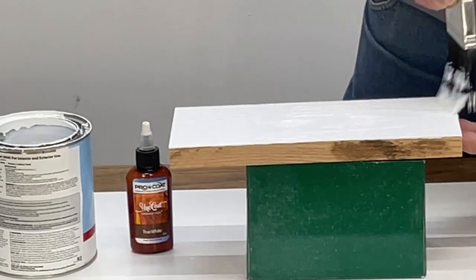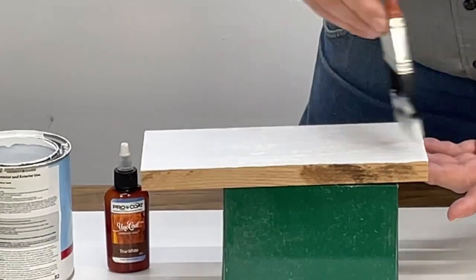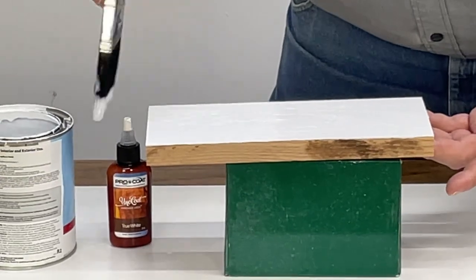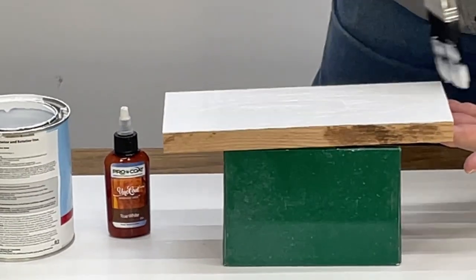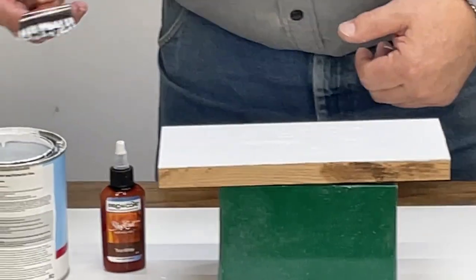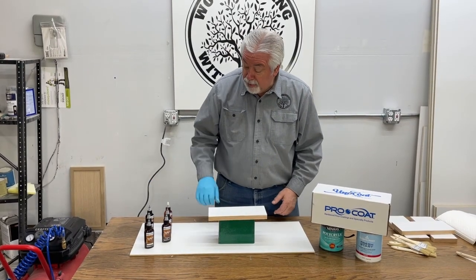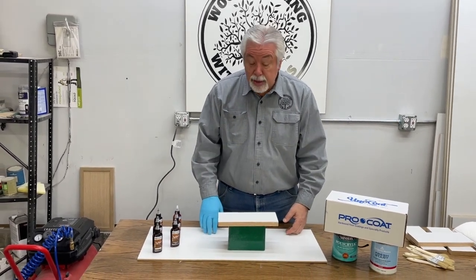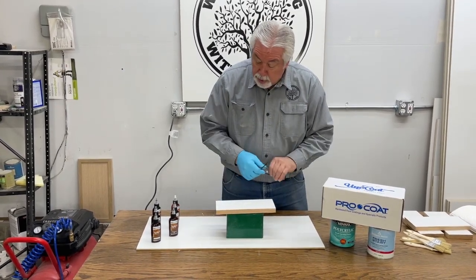We did a door with this white paint and black Unicoat glaze — I invite you to go back and look at that video. We are not going to do the white on black again; we're going to use some other colors. But you want to make sure that you don't get your paint so thick that you fill up the grain you just finished wire brushing out. There's our first coat of paint. We'll wait for that to dry, come back and give it a second coat, then a thin coat of polyacrylic for our glaze. We've picked out six colors from the sample pack — varying shades I think you'd like to see. Here is our sample, all painted white and sealed.